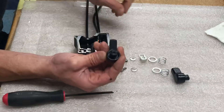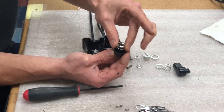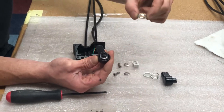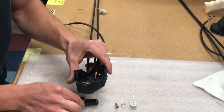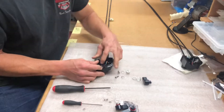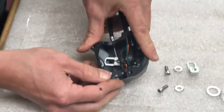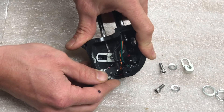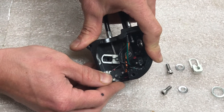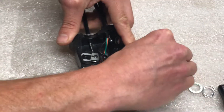Have it sitting down here like this. Then place the knob, then the spring, then the spacer. You can see on the knob and on the cable clasp where there are flat parts. See how they're not lined up there — now they are lined up. You want to try to keep those lined up as you put the screw and washer in.